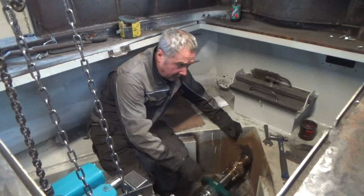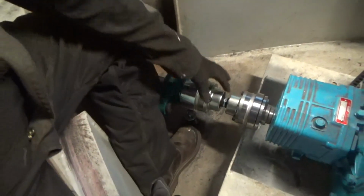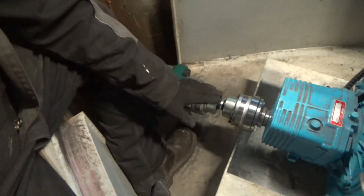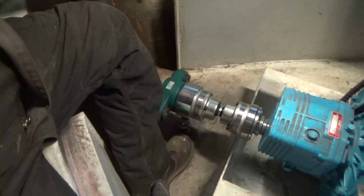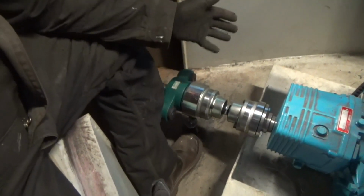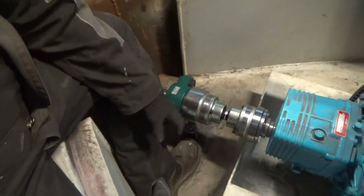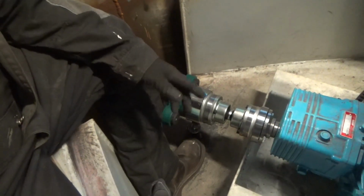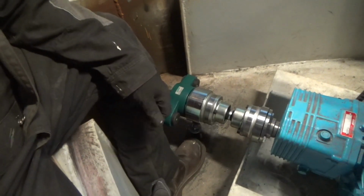And this Aqua coupling, this Aqua drive, allows for differences between the gearbox flange there and the prop shaft. It can be 30 degrees out, which is a heck of a way out. It just gives a lot quieter drive to the motor and everything, so your boat doesn't rattle around so much and the noise doesn't get transferred through.